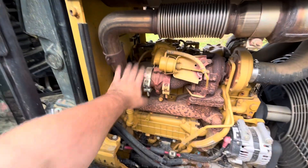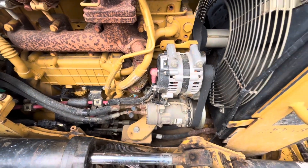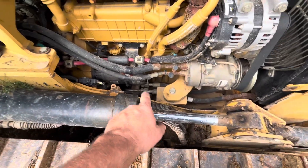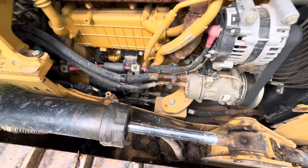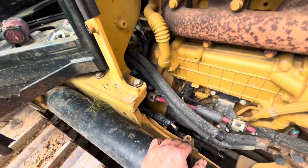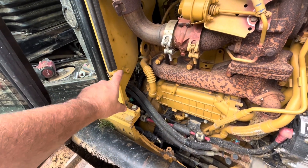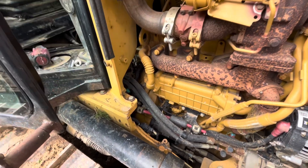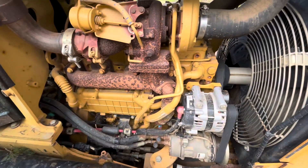On the other side of the engine, we're going to pull the exhaust at the turbo or at the back pressure valve and lift all that off with the hood. We are going to pull the compressor off and lay it to the side so that we don't have to evacuate the whole system. We're going to unhook all the wiring from the starter. There are two hydraulic cooler lines down there we're going to leave in place. Essentially when we pull this thing, we're going to pull the bell housing bolts, and the rear mounts for the engine are actually on that pump housing plate. So we can leave the pump just kind of hanging, pull these front mount plates, and then slide the engine forward enough to get it uncoupled.